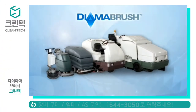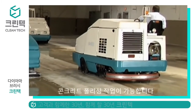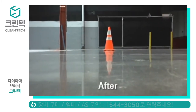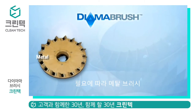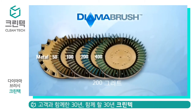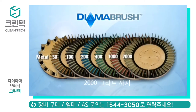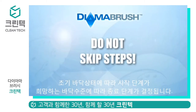Transform your ordinary floor cleaning machine into a concrete polishing machine without harsh chemicals. Starting with the metal brush in the system, then progressing through the polymer grit brushes: 50 grit gold, 100 grit black, 200 grit blue, 400 grit green, 1000 grit red, and finally 2000 grit tan — making sure that steps are not skipped in the process.